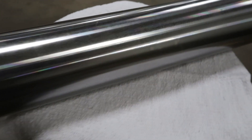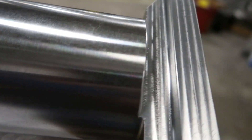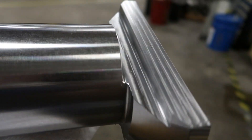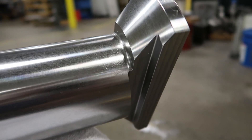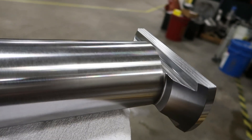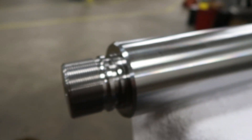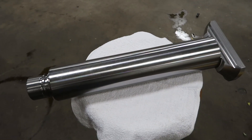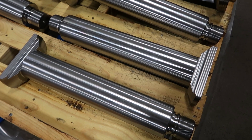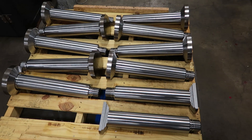Here's the finished part as far as my machining goes. It's going to be ground on the OD and then nickel plated from the threaded end all the way through, including the T. I think it's some kind of hydraulic cylinder ram, so the OD of that turned area has to have a nice finish after grinding. We've got two of them finished now and nine more pieces to go. Thanks for watching and please subscribe if you haven't done so.